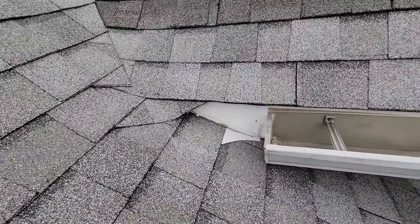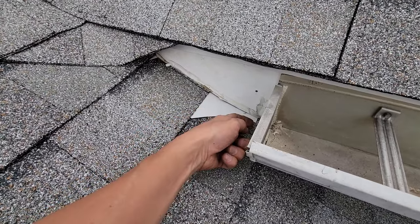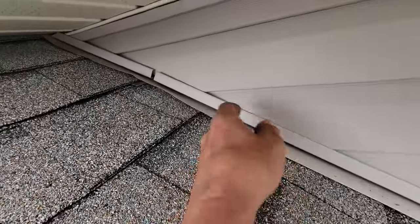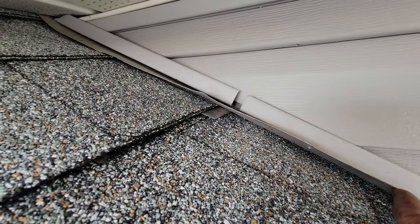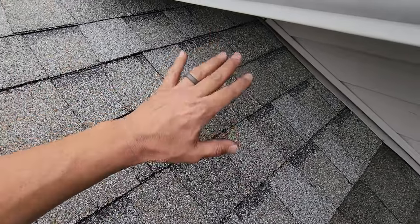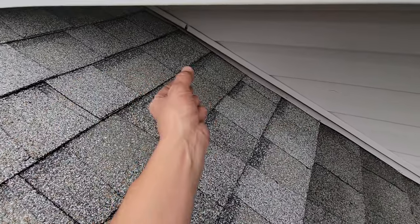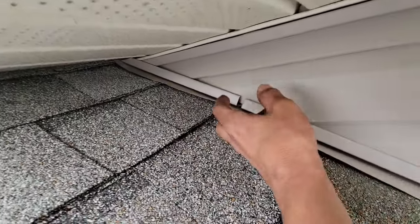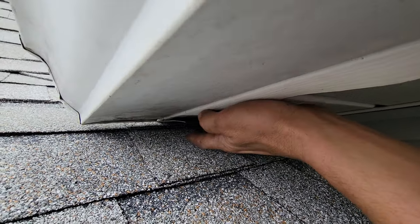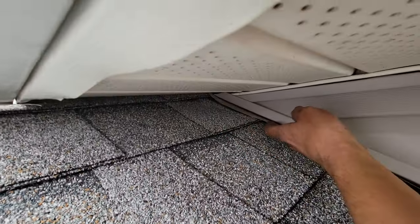As far as the repair and the flashing side of this: cut the caulking, remove it. I did leave a little part visible with a web coming down purposely because this row here is a solid shingle all the way over. If you go under here you can see the siding trim they have, but there's also step flashing up under there. It was all nailed beyond the J-channel — I could not adjust that — but they were all perfectly set for the 5 and 5/8-inch exposure, so it's good. I did have to pop this soffit piece out, that's why it's a little bent right here. I had to pull this down to get it out. I notched it so I could get it bent and tucked back up in there. This row coming over is under the step flashing.